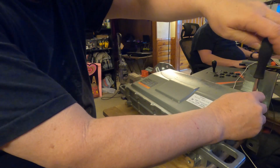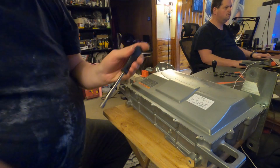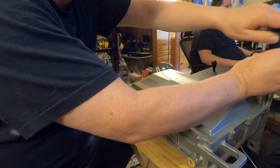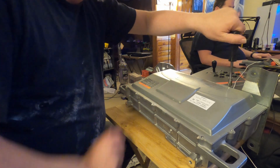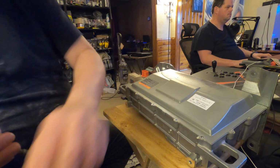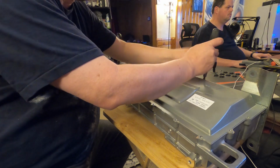If your diode fails short, this is where the forums get very helpful to you. There's a fix out there that all you have to do is remove the charge connector off the front of the car, which is still fiddly, but far less so than dinking with this. And you can then splice a replacement diode into the wiring. If yours fails in that fashion, I highly recommend going that route, because that will be far less intrusive than what we're doing here, and if it fails again, easier to replace.